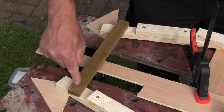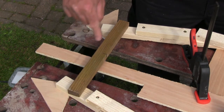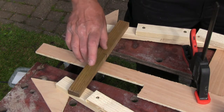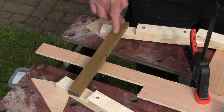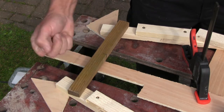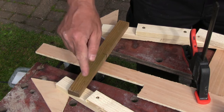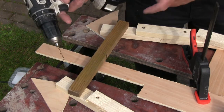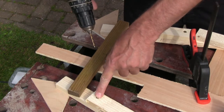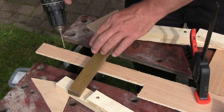Going to be placing 2 screws into this staggered, so that this then becomes the stabilizing piece. If we just put 1 screw in there, it will have a tendency to pivot. I'm using a drill bit to drill, but this is really cheap wood. If I attempt to screw or nail into this without doing a pilot hole first, the end of the wood will split.